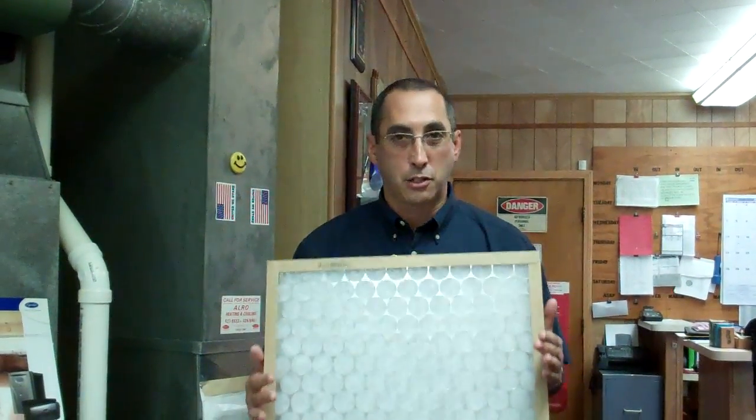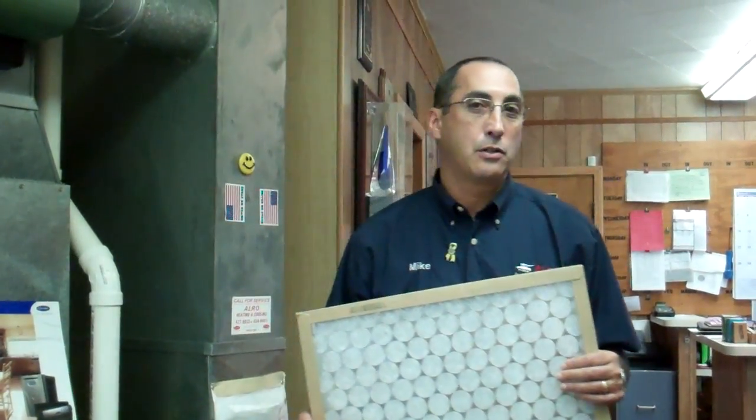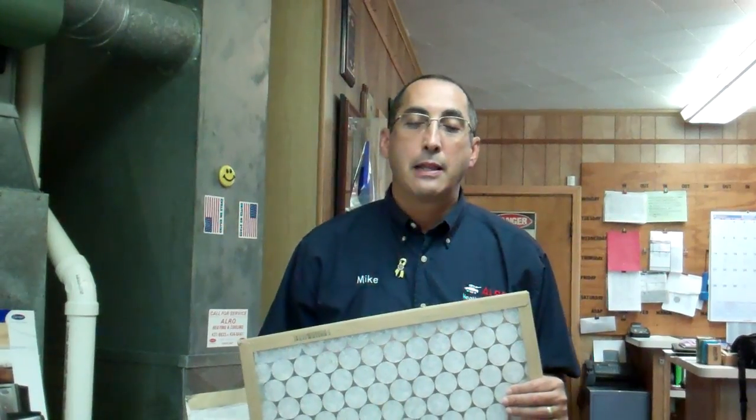I highly recommend the inexpensive variety of these if you're going to stay with a paper fiberglass disposable filter. We do not recommend the washable kind of filters. A lot of people get those and think they're saving money or they're doing something good. Those are very bad. They don't do a very good job of filtering. They block very easily because they're very tight mesh, and people tend to forget about them, and so they get extremely dirty and they just let all this dirt into a furnace. So we don't recommend washables at all.